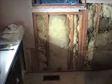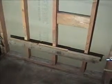There you go. So I've gotten everything as ready as I can. I've cut out the wall even bigger than before to make sure the tub fits in nice and smooth, and I've cleaned up all the edges. Swept up the bottom with all the little bit of mouse poop and their little nest and whatnot. This support bar in the back here, I believe I'm going to have to raise that up. I think it's at a different height than it needs to be. And yeah, now we just have to carefully bring the tub in and set it in there, measure it, move that support to the proper height, put in the safety locks, and Bob's your uncle.